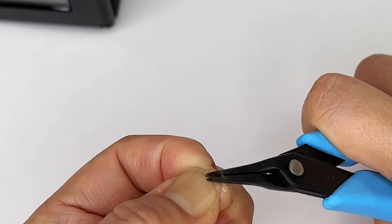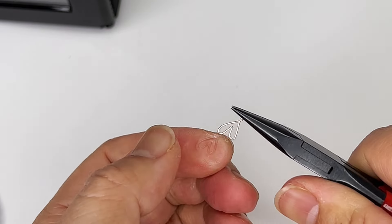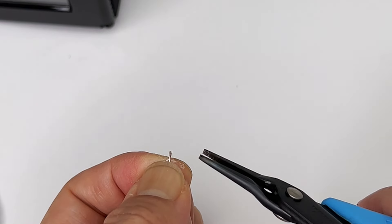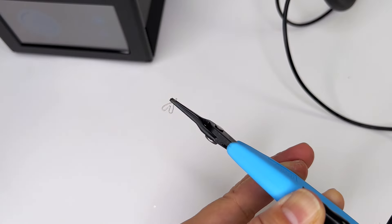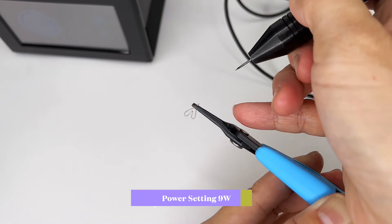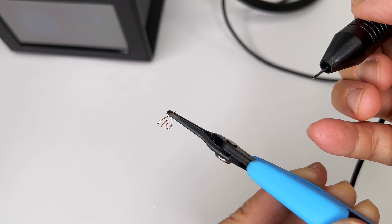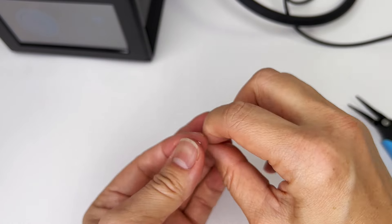If these pairs of pliers are not strong enough and you want it to twist, I always have another pair holding it — like such. Now I am ready to weld. Here's the point — I'm going to weld at 9 watts. This is 24 gauge; basically I want this to ball. There you go — it balled. Now let me find the other one and see if I like that situation.